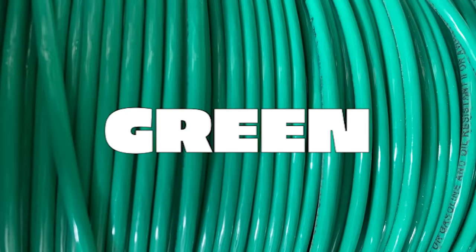All the hots have a whole plethora of different colors, and it depends if you're in a single phase or three phase environment as to what those colors will be. Pretty standard across the board, we're going to start with the green wire. Green is what's known as ground — overseas in Europe they call it earth, but it's the same thing. It's what's tied to earth, to the ground.